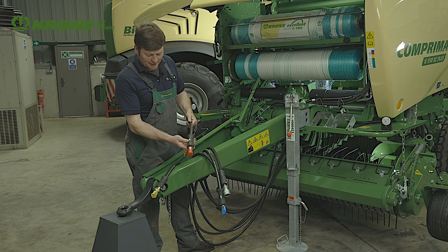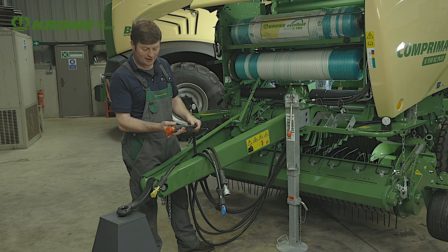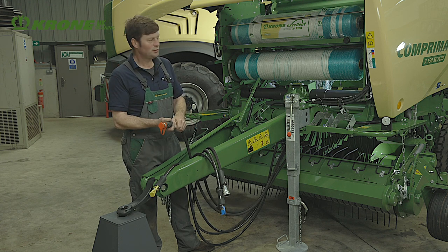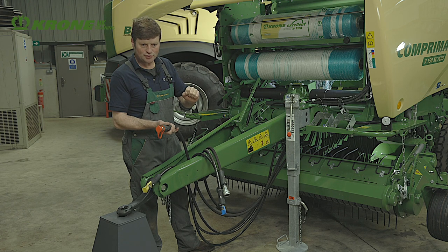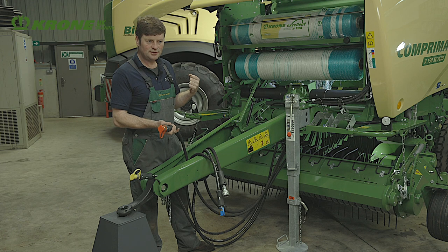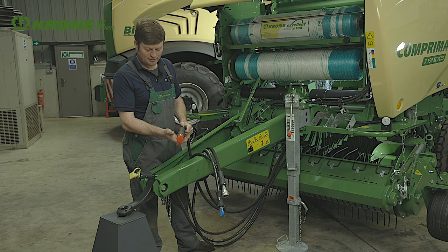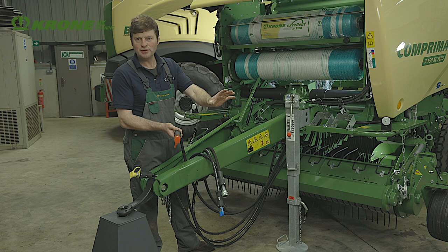The red connector 1-plus is to open and close the tailgate, so you plug it into the spool. When you open the tailgate, you charge the baler for bale density — you keep it pressurized for a moment, which pressurizes the chamber. Then whilst you're baling, you just float the spool and drive.